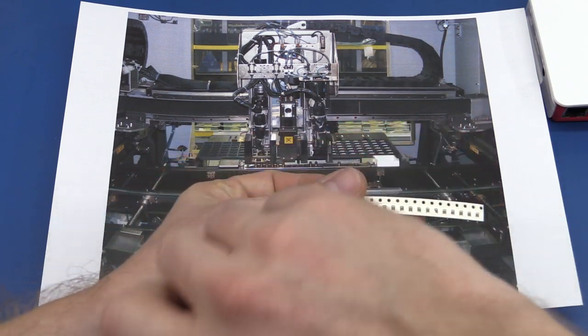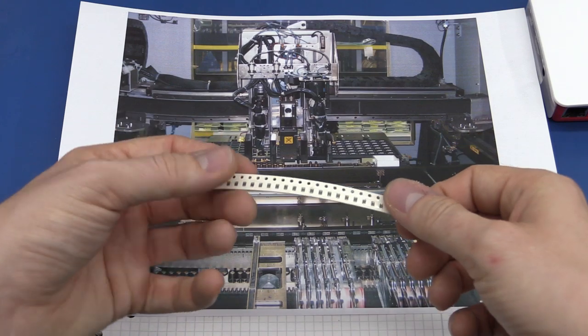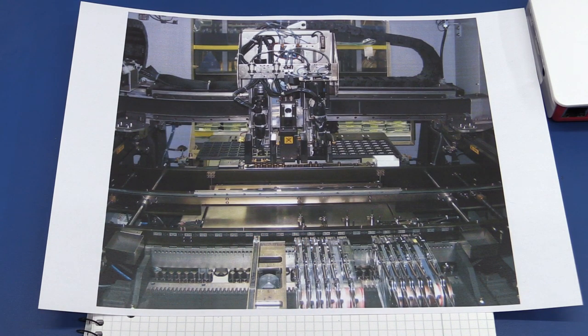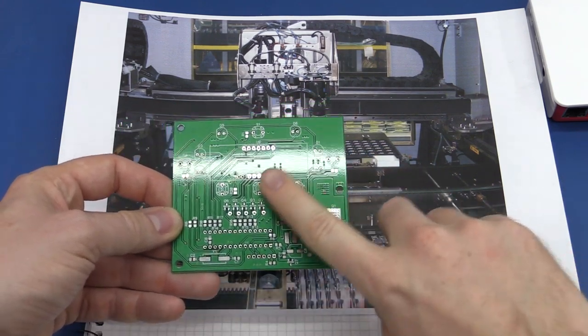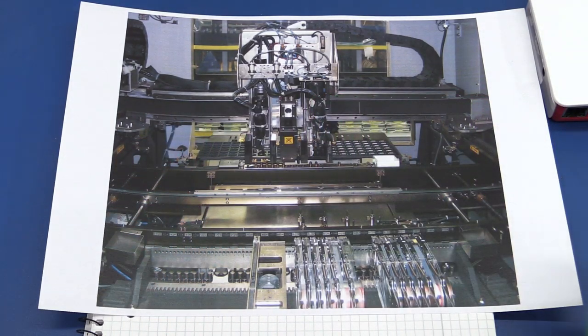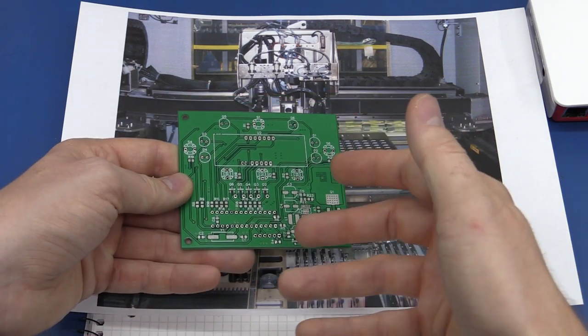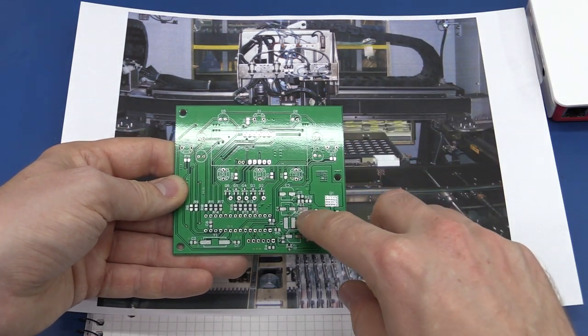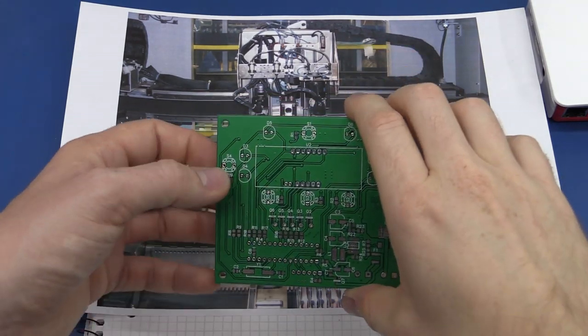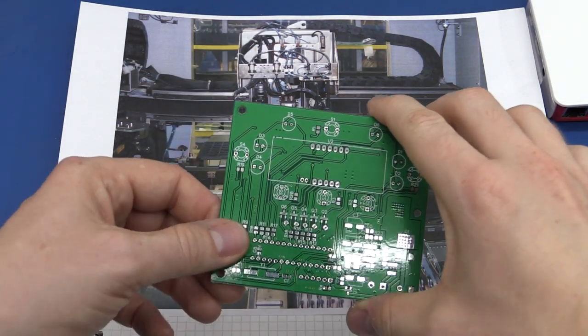That means I have to pull back all the tape at once, and yeah, that has some disadvantages, obviously. The good thing is that a feeder can always be added, and it's not that difficult to change the program if you take it into account from the beginning. So after the board has had all the components mounted, it will go forward out of the machine, and it will go into an oven basically that heats it up and melts the solder paste, and that's what creates the solder joint. And after that, you might have to add some through-hole parts and solder them, and then your board